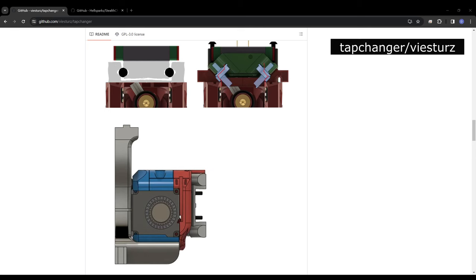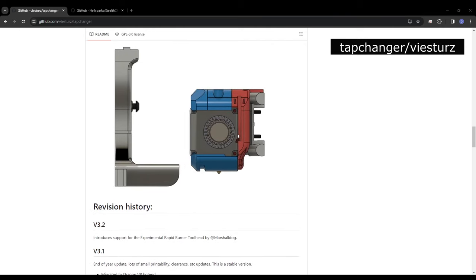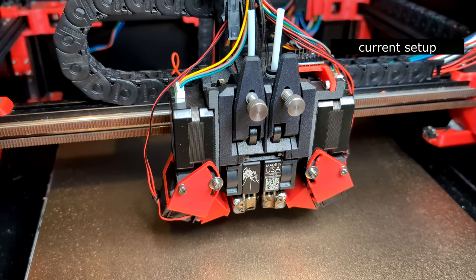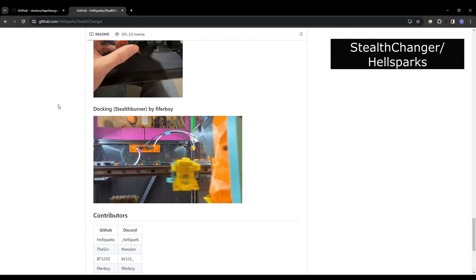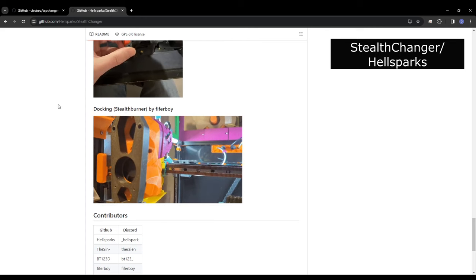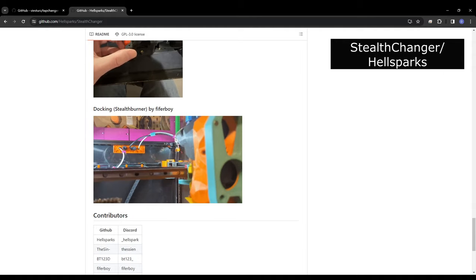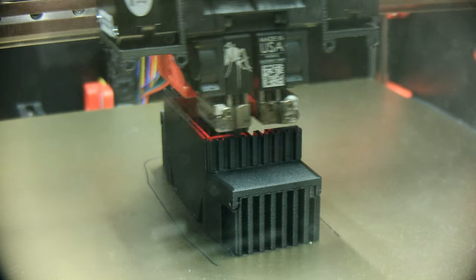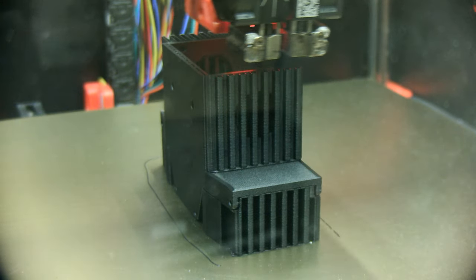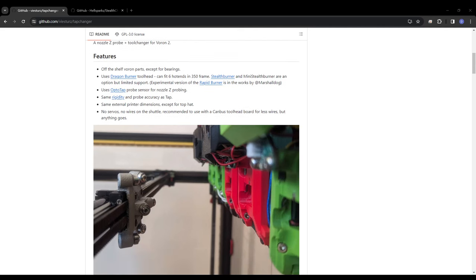The tool changer is a solution for multi-material 3D printing that involves a system with multiple tool heads. Unlike the first modification, each tool head has a nozzle and can load a single filament individually. This configuration reduces the weight of the printhead and enables high-speed printing. Although rapid 3D printing is not always desired, a boost in print speed is still welcome. Therefore, the key to the tool changer system is the weight of the tool heads.